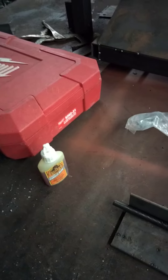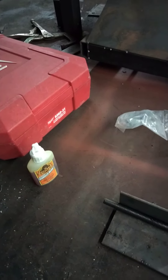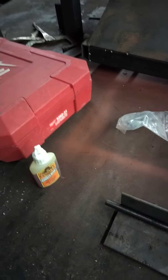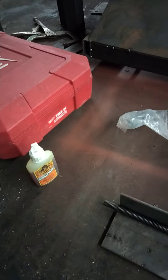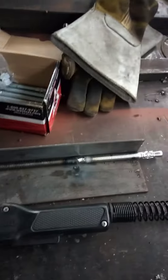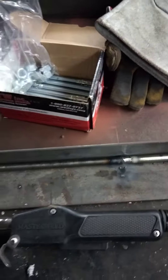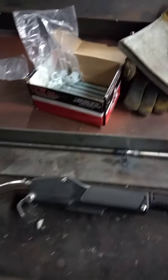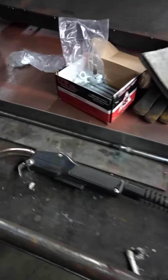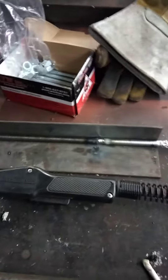I always make sure and primer the bottoms of my plates and stuff. Nothing looks worse than a bunch of brown rust running down somebody's curb from the rust on the bottom of your plates. If you're going to buy long concrete bolts, just get some shorter ones and get some grade 8 all-thread and weld the things on. This was $990 for 28 bolts and I'll have maybe 50 bucks into it this way. Just passing that on - everybody be safe.